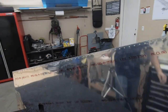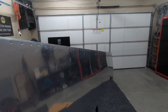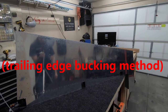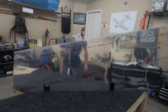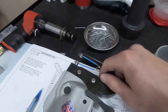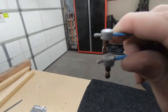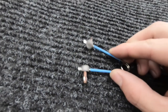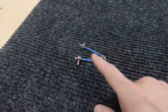I'm incredibly pleased with the results from this trailing edge — it is nice and straight, which is beautiful. I know there are a couple of methods to do this. I tried previously to do the bucking method that Vans outlines in their manual, but I ended up having a lot of success and consistency using the Cleveland Aircraft Tools little attachment. It's a spring-loaded attachment with the angle of the trailing edge built into the dies. You actually start out with a standard head, get it partially squeezed to where it holds itself in, and then transition over to these. That's my method — not a how-to guide, just the way I did things.